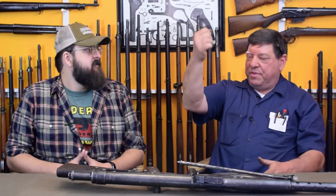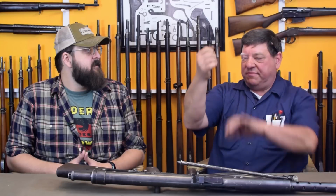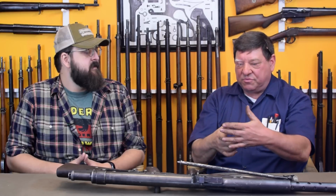It does. So otherwise, any impressions on the Madsen? I mean, this is a rare gun, Mark. Did it strike you as being completely unusual? No, actually, other than the fact that the breech block's doing the swing up and down. It comes up for extraction, it drops down to feed, and then it comes up to lock. And it was really weird how it was timed. It was hitting the primers off center on every round, but it was closed.